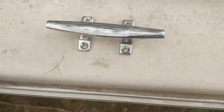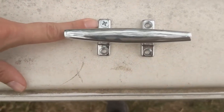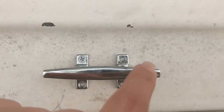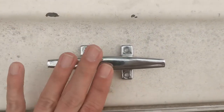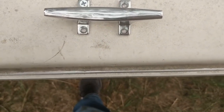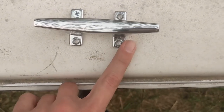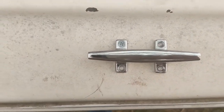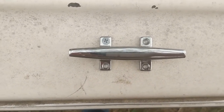So because processes always improve, I've got the first one in here. And I think this time I'm going to just drill out the holes one at a time and place screws in them with the cleat on, because the drill bit clearance is just small enough to fit into the screw holes. This way I can keep it aligned and I'm not going to have any funny holes out of alignment ever so slightly. So we're going to do it that way.